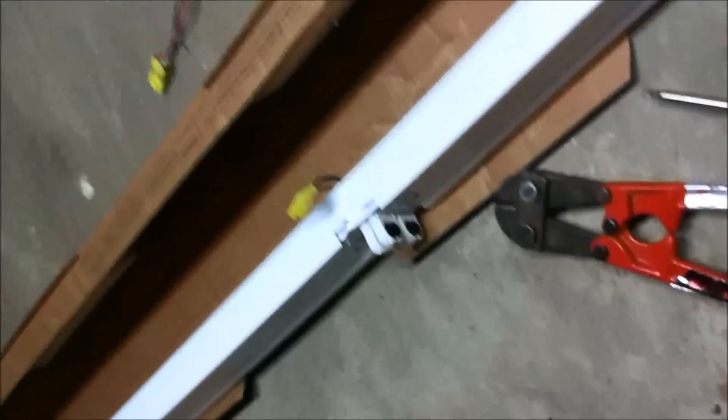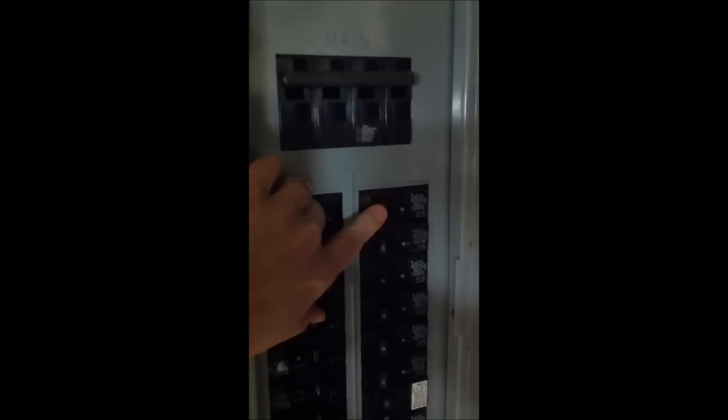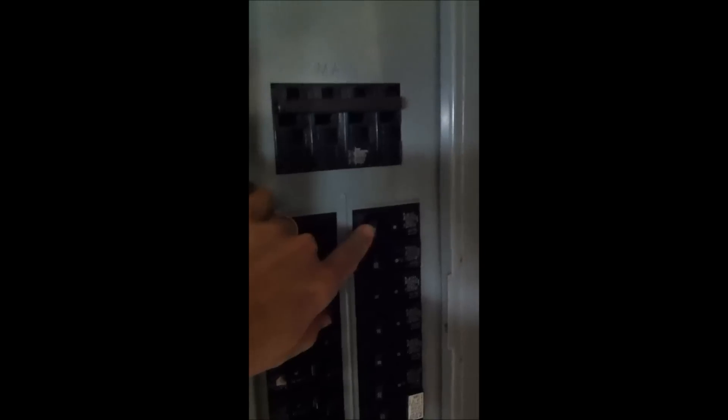I got this fish light set up here — all my fish died so I just used their light for projects. Here's what I'm going to convert: a light socket linked in series or parallel. Anyway, you unscrew the fixture and get the wire underneath. I've got a little unconventional setup here — basically running a wire from the old bulb location to a place that actually lights something useful. Your setup will be basically the same: green for ground or bare copper wire, white for neutral, and black for hot.